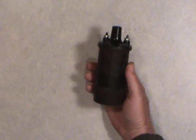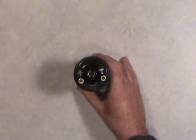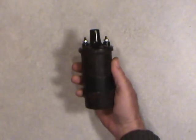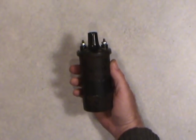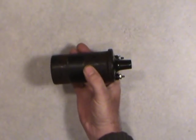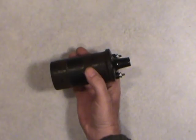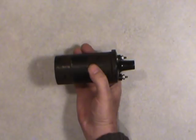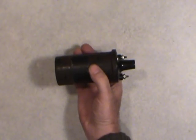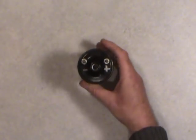You just have to keep an eye on these — make sure the connections are clean and it's not leaking oil. This particular one was horizontally mounted. If it had been vertically mounted you could probably keep using it, but since it's horizontal it started to leak, and once enough oil leaks out it would lose its cooling ability and the coils would probably overheat and stop working altogether.